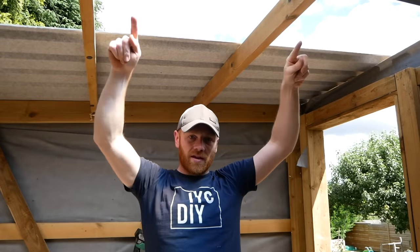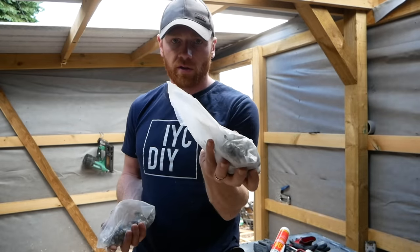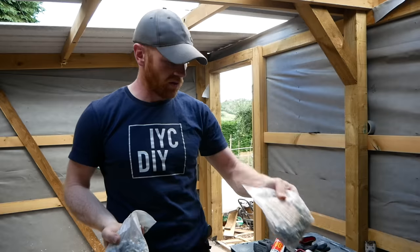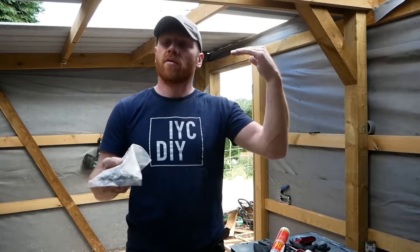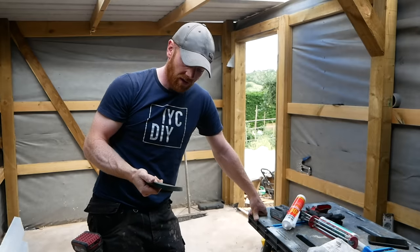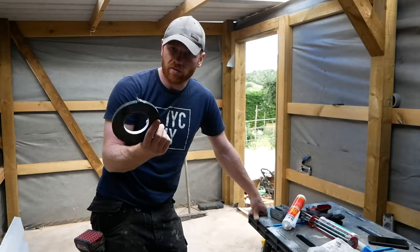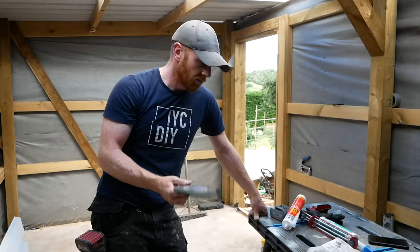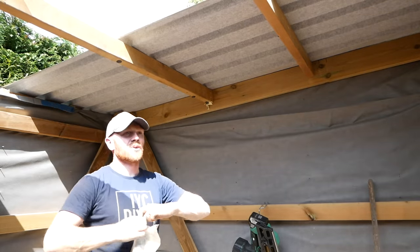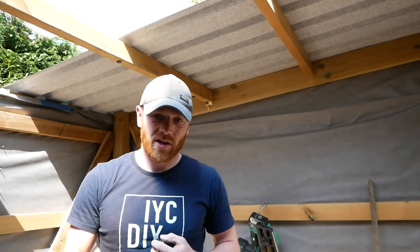I've shifted the roof sheets to the side and we're going to start working on our first sheet. There are two types of screws — the normal ones which go down through the flat section on this with a weatherproof washer, and then you also get these small stitching screws which are used where you've got a sheet-to-sheet connection. Most manufacturers recommend a tape where you lap over the sheets. I already had a load of this stuff from when we did the porch — it's a waterproof double-sided foam tape or a butyl tape. I'm also going to use a general purpose clear silicone which will be fine as well. I've levelled up this first sheet, made sure it's in the gutter the correct amount, got a good overhang and measured across.